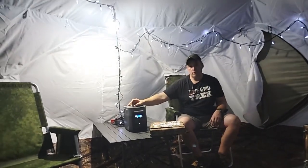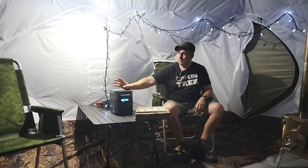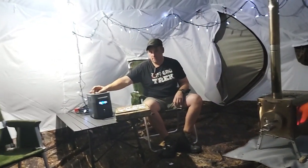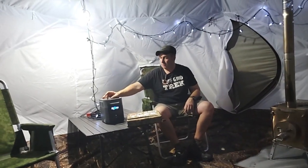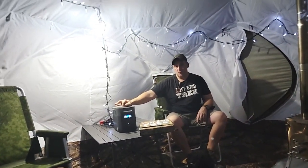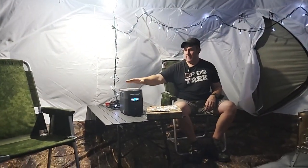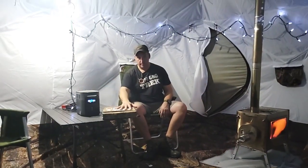This is less than 24 pounds — 23.6 pounds. It can charge from up to 300 watts of solar at 75 volts. That's huge, because the Delta — which is the next size up — is only 65 volts. Basically, that means this is actually going to charge quicker from a higher voltage solar blanket like what we offer here, compared to the Delta.